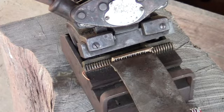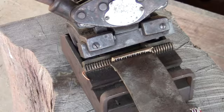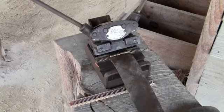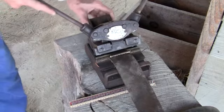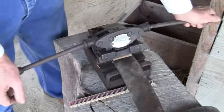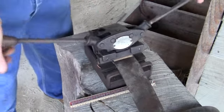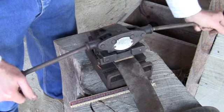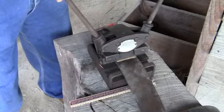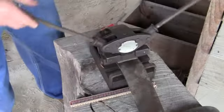We've now placed the belt in the clipper links, which are in the machine. The next thing we'll do is use the arms to crimp it down so that the links go into the leather belt. The jaws are adjustable, so first we get them down until they're just touching, then lock them in place, and with the crimper, crimp it down gradually — moving it up a little and crimping repeatedly until we're sure we've got it all the way down. It's looking pretty good.